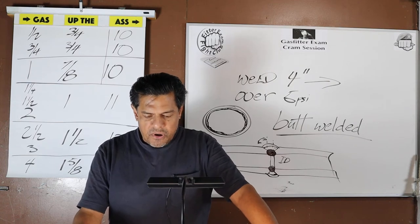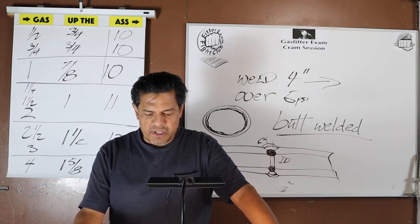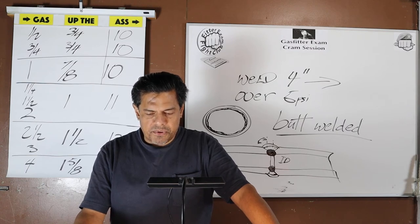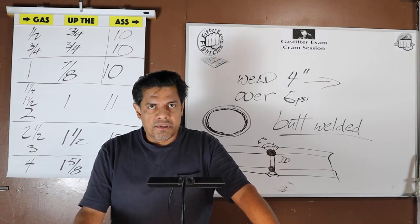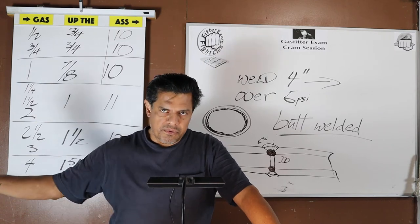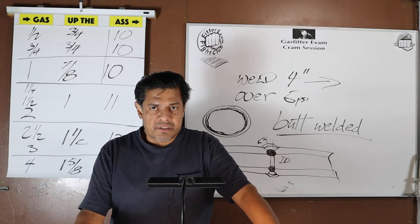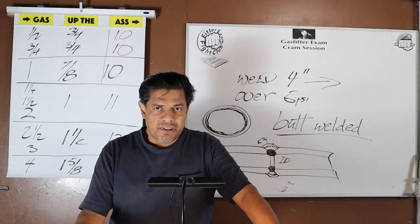We've been repeating it over and over again, and we just repeated it again. Threaded piping may only be used up to 4 inches at pressures no greater than half a PSI. So we said, buildings are not going to have more than half a PSI, with exceptions. Here, those half PSI systems, the largest threaded fitting you're ever going to be able to use is a 4-inch fitting.